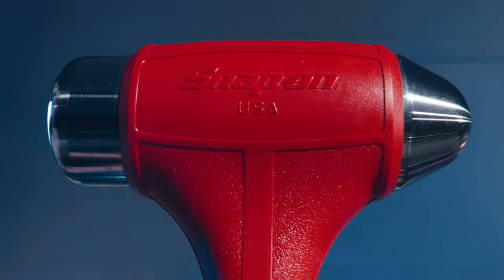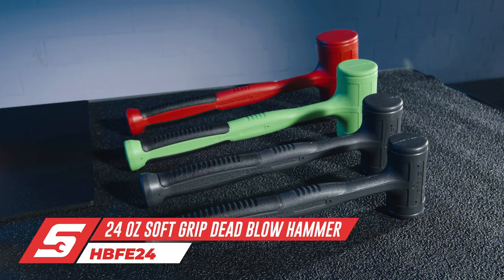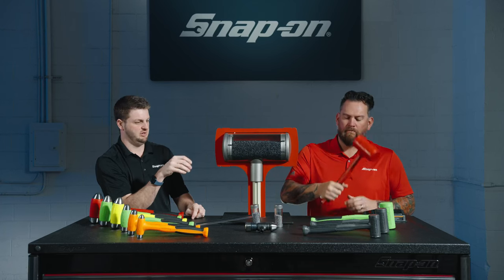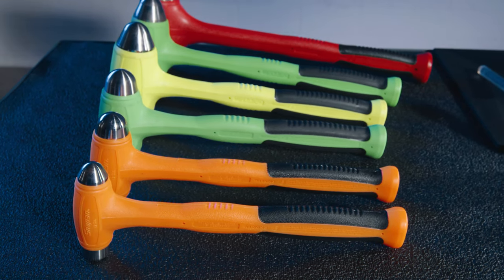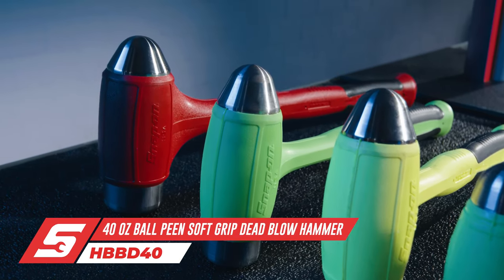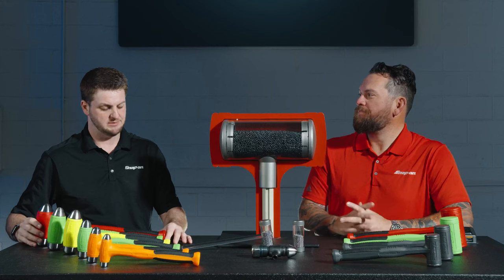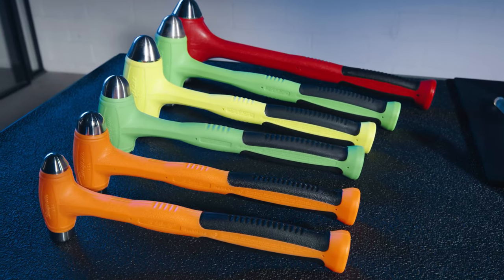There's a variety of hammer sizes. On the dead blow side we have 16, 24, 32, 48, and 56 ounce — a nice variety with the 56 for big jobs and 16 for small jobs. On the ball peen side we step down to an 8 ounce for precision work like running a punch or chisel, then step up to 16, 24, 32, 40, and a brand new 56 ounce, because technicians asked for something heavier for demanding jobs, especially in heavy-duty shops.